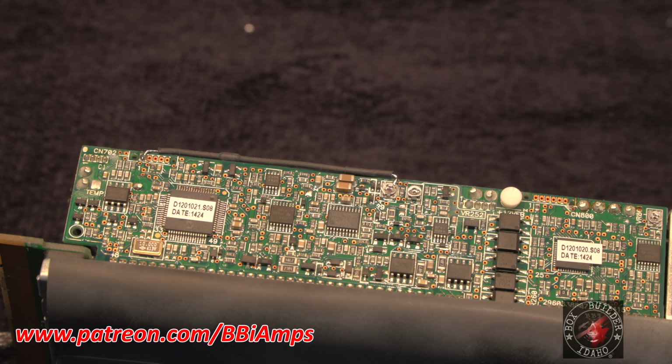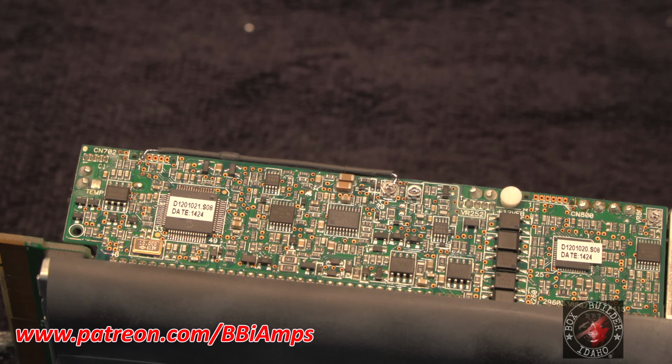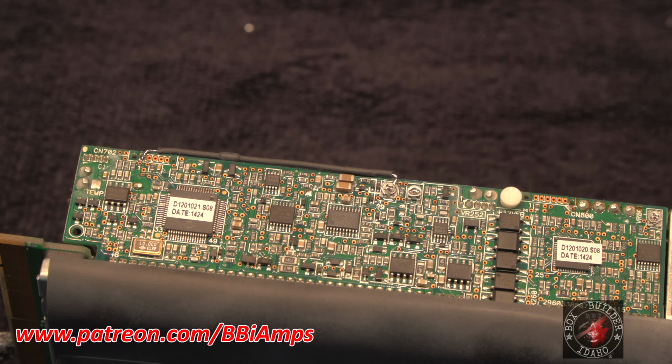Okay, so I got this working the way I want it to now, and I'm happy. So let me cover some notes, because I know other builders out there and other people on the internet are going to want to know how to do this. So for specific reasons, this is the DPS-1200SB, a relatively cheap little power supply made by HP. For us to get the voltage that we want, we have to adjust a couple things. We have to add 2 resistors.